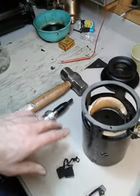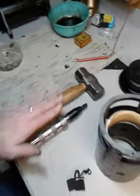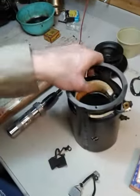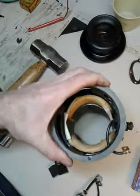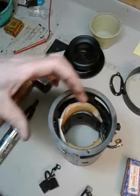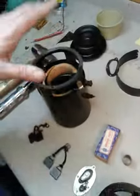I tighten them up by hand as much as possible and I set them down on a hard concrete floor with a little bit of padding and I use the mallet and the impact wrench to tighten these screws, get them set so it pulls those shoes completely tight and compresses the coils a little bit also. Then I'll test fit the armature to make sure it fits in. It took a little bit of work but it's really important to get those really tight and make sure they're seated properly so the armature will fit, because of the really tight clearance. So that's the field coils.